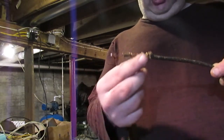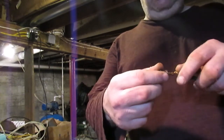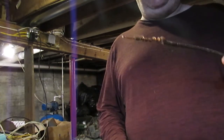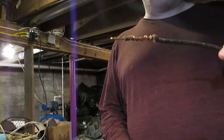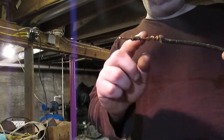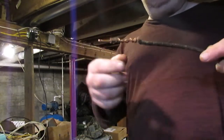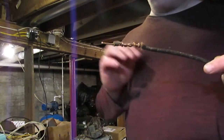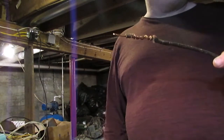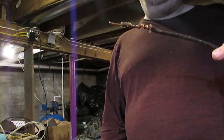Now there's sufficient wrapping on there, you know, the wire is wrapped around there tightly. However, they failed to put any solder on those joints, and it was this way all through this house. I took some of the stuff out of the walls upstairs, and there was just dozens and dozens of splices in this wire all through the house, and that's how it was.